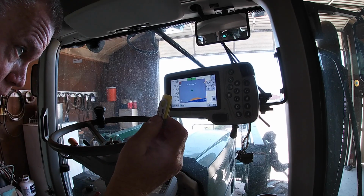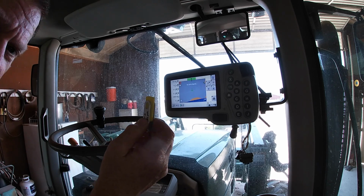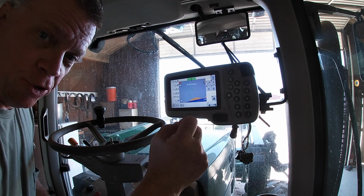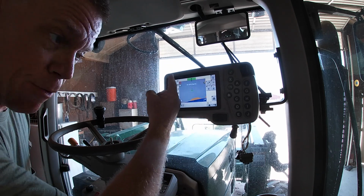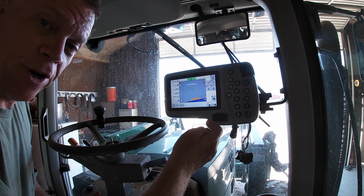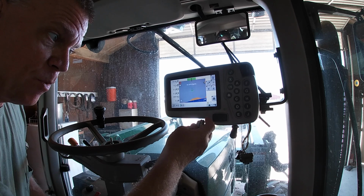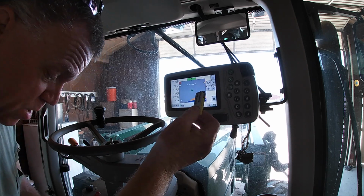I have downloaded the update from Deere's website. It's not clear when you go into the StellarSupport website. There's two different downloads it shows you: one for the displays, whichever display you're using, this is the 1800, and one for the receiver. I downloaded the one for the receiver, and then as I'm reading, it says you should probably update the display as well. So I got another USB stick, updated the display, looked at the files on the two USB sticks, and they're exactly the same. So I only needed to do one download, apparently.